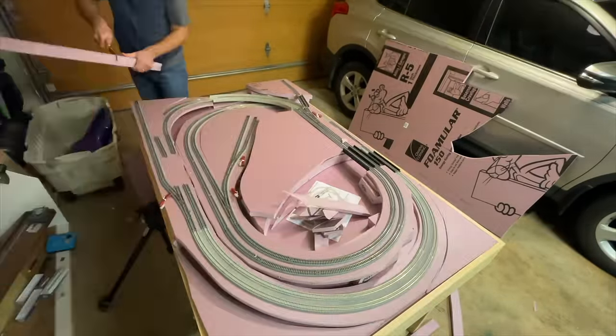I had my DS64 units in the middle here, the terminal strip above that that joins the wires from the push buttons to those that connect to the DS64 units, the Digitrax panel up on top here for connecting the handheld throttles, that is in turn connected to the Zephyr base station by a single cable. All the wires to the control switches for the layout lighting run through the fascia here on the top right, and then to this terminal strip to which I can connect the future lighting.